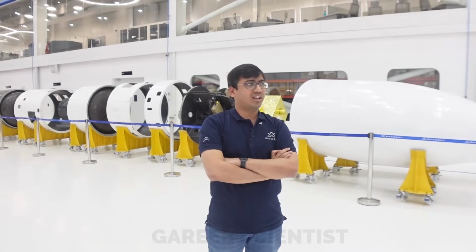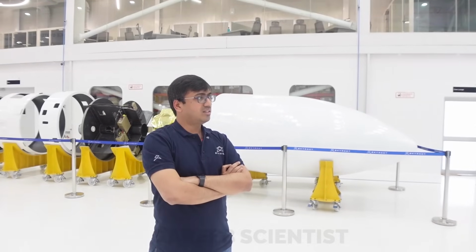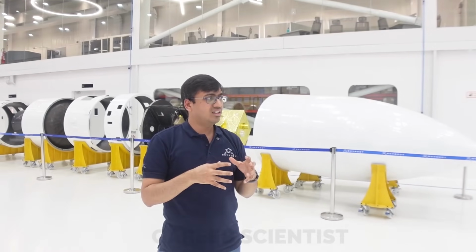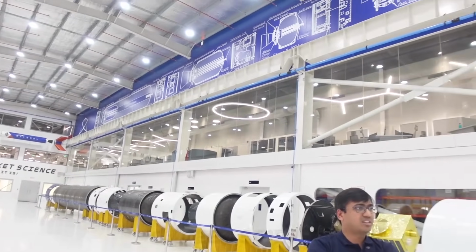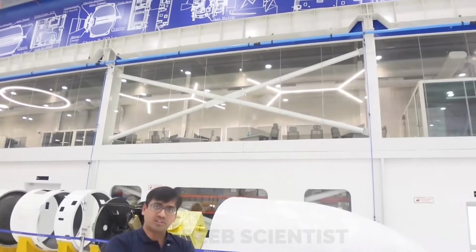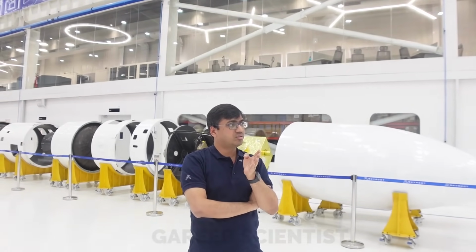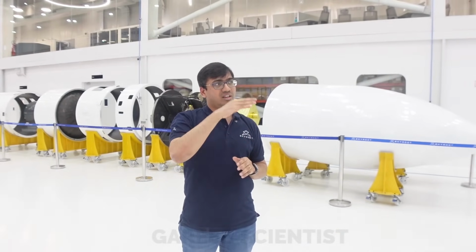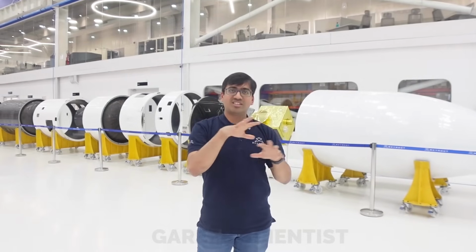Small details. Building rockets involves so many engineering judgments to be made, in very thin margins, and across hundreds of systems working together, everything related to each other. Correct. It's quite a challenge, and that's why the design keeps evolving with time, through several iterations. Even for each grain, we do several hundreds of iterations. Which grain is ideal? Even a 2-3 kilopascal dynamic pressure reduction affects the burn time, and everything is related to everything else.